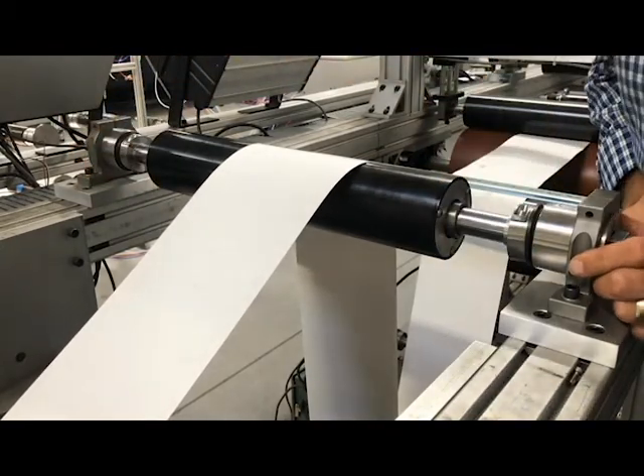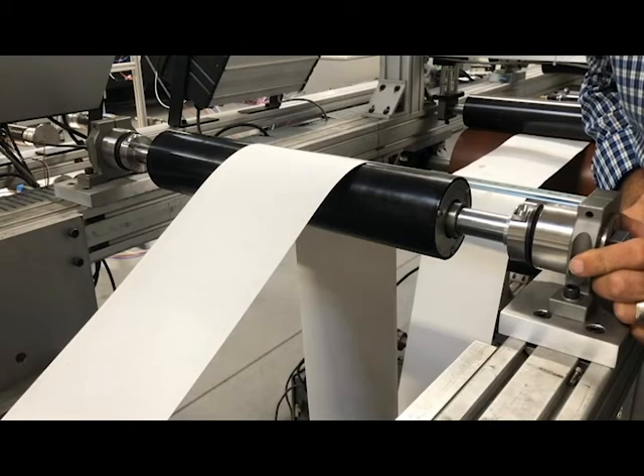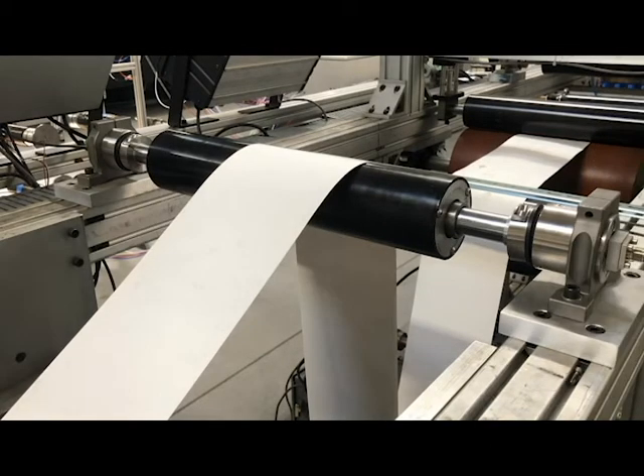This is normal free play in the anti-rotation mechanism inside the load cells. If there is no free play, loosen the mounting bolt on one side and rotate it slightly until the free play is detected, then secure the mounting bolt. If the free play is still not present, it can affect the load cell calibration procedure and overall load cell performance.